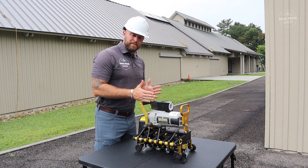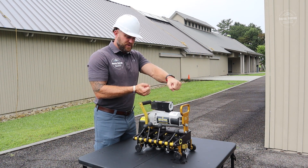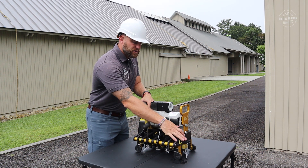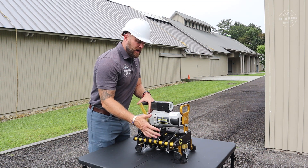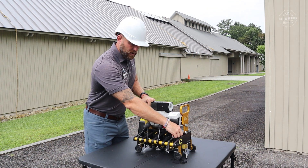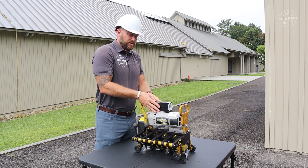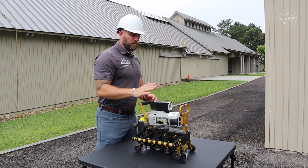Your panels are going to be pre-crimped as you put the seamer on. Once it's on there, each machine has its own guide on how to use the levers. On this particular one, you go one, two, three, four, and then push down and it seams up the roof.